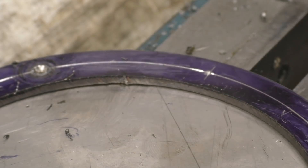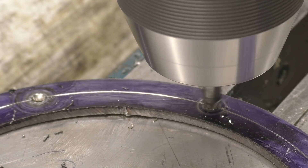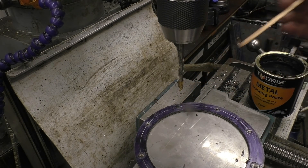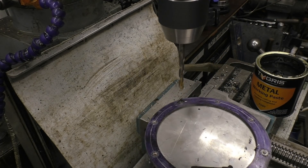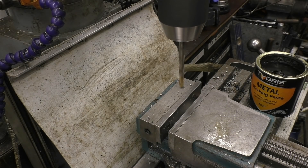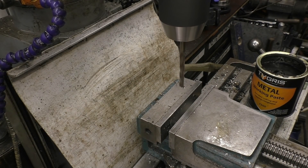I think this is 316 stainless — it's the best grade of stainless I can sort of find and get hold of in small quantities. I'm going to put these holes through at 6.5mm so I've got clearance for the 6mm bolts. I might actually weld the nuts on the back, I'm not quite sure, I'll see how it goes. Doesn't like that at all — that is a sharp drill. I'll try a cobalt drill but a bit slower, quite a lot slower. That's better, that's nice.